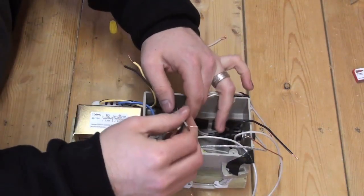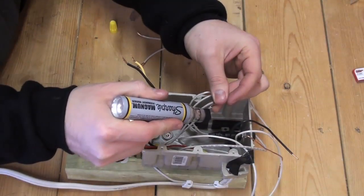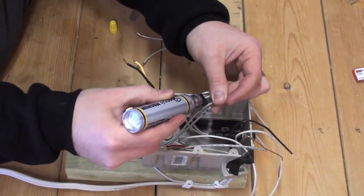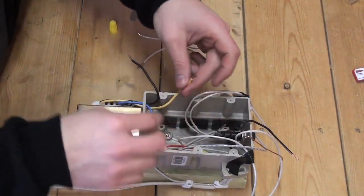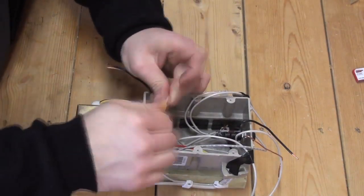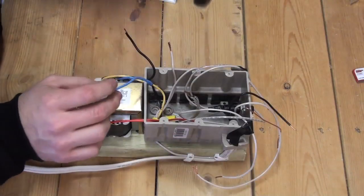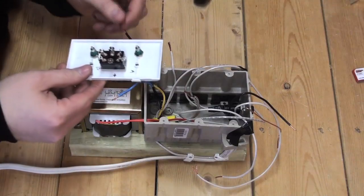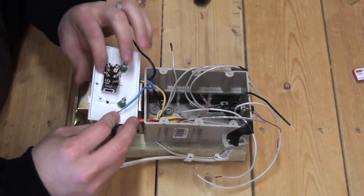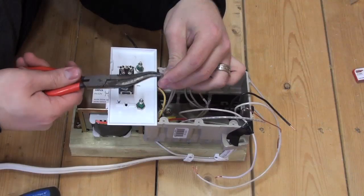Place the wires out of the way and then mark them as positive. Take the yellow neutral wire and repeat the previous steps by attaching 2 lengths of connection wire and burying out of the way. The blue neutral and yellow-black positive wires should remain. These will attach to the common terminal on the toggle switch, but remember which sides of the switch are designated as positive and those as neutral. Take care to not reverse their placement.